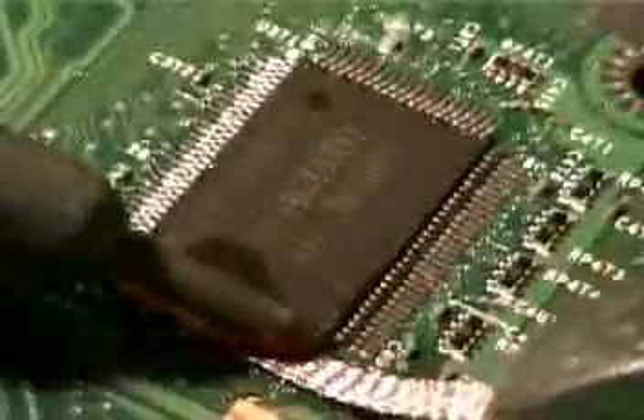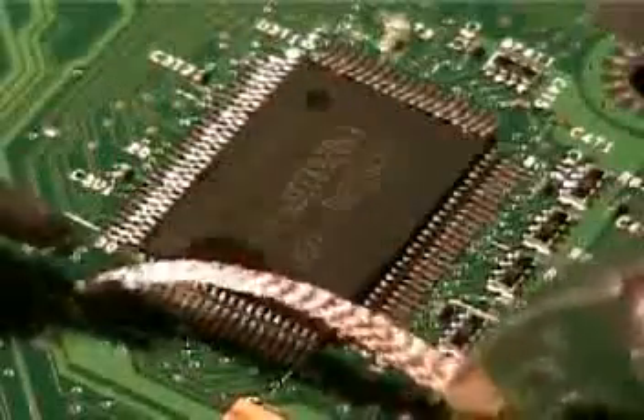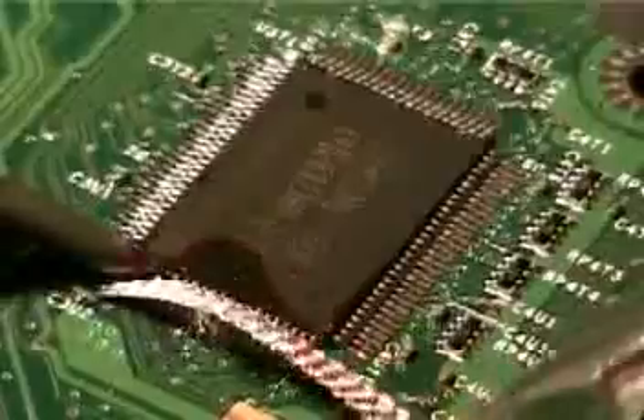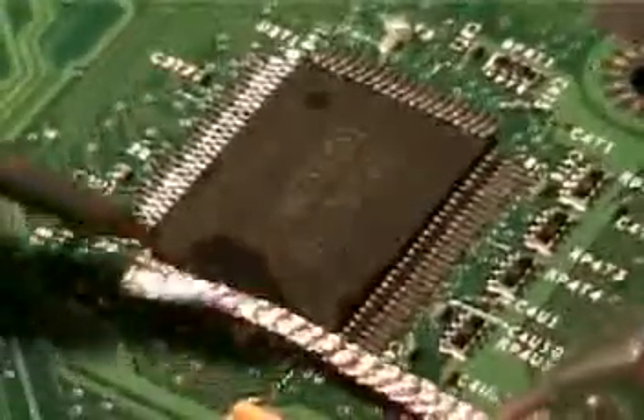You can just go across the whole side — not real tough at all. Make sure you do get it all though, because if there's any solder left on there, when we actually lift these legs off of the motherboard we'll run into problems.